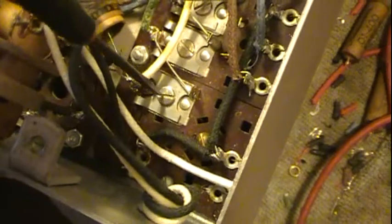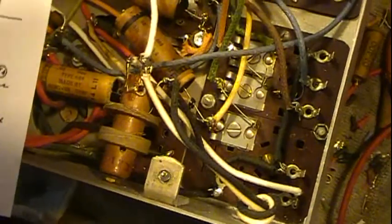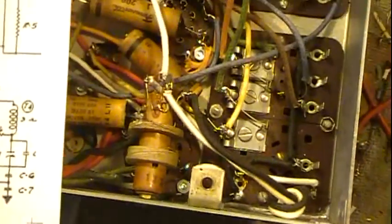There's a coil hooked to this. There's a capacitor here, which is a 0.05, and buried underneath is a dog bone resistor. That's brown, black with a yellow dot, 100K. And by the way, all these are restuffed caps, and that's what I'm doing in this, is restuffing them.